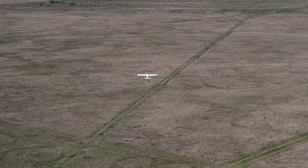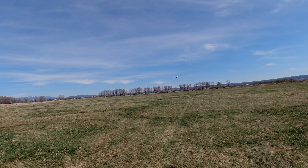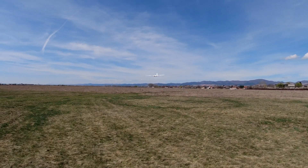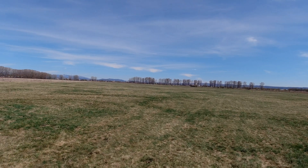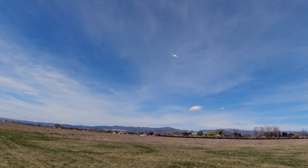There was a bit of headwind to help and it just pulled up and went on its merry way. I felt so relieved seeing how easy it went up. Playing around with it following the takeoff revealed that it is quite stable and definitely not prone to tip stalling. I flew it around in manual mode and it didn't really need much trimming in any direction, which was nice. It looks impressive flying by when it gets closer and you get an idea of its size, but it also looks as if it's on rails. Estimated takeoff weight right now is around 7.5 kilograms, which adds inertia and contributes to the overall solid feeling of the plane.